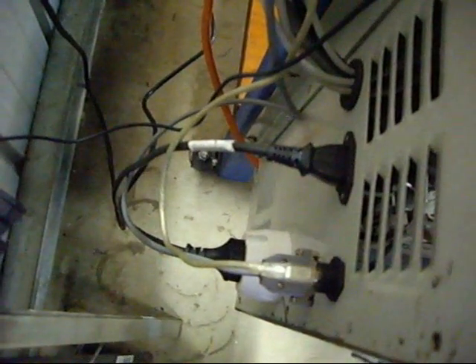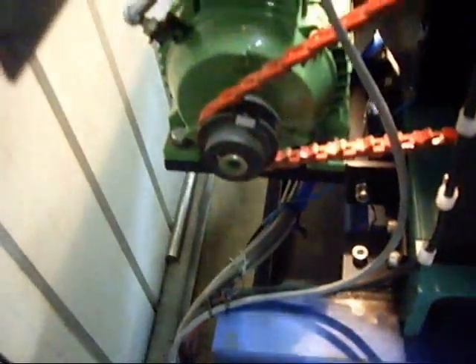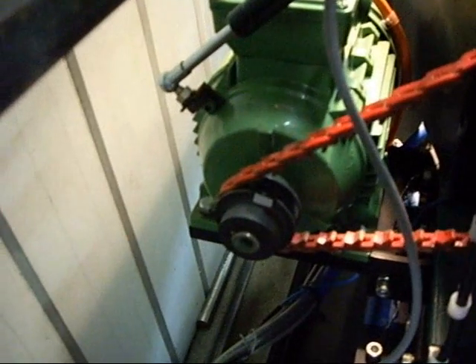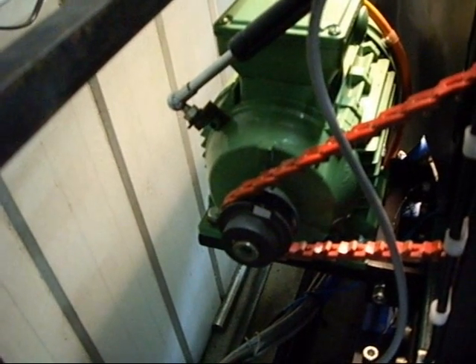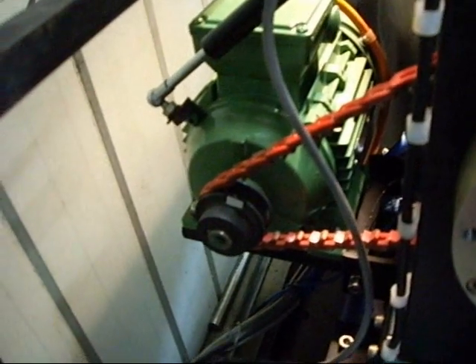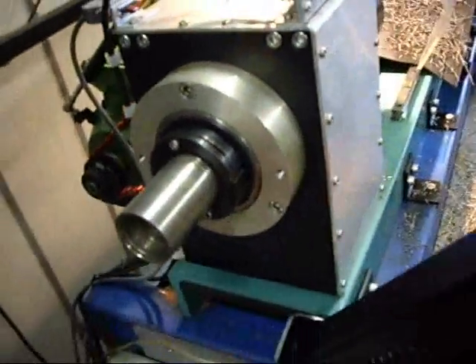Let's see if I can get around the back here — I won't be able to see anything. Basically down there somewhere there's the power, USB port, coolant out, and all the cabling necessary to go up to the front panel. Three phase motor, seven hundred and fifty watts, one horsepower. The belt reduction is roughly three to one — it's roughly a two inch pulley with a six inch pulley on the spindle.